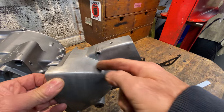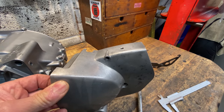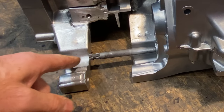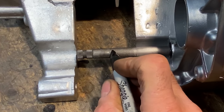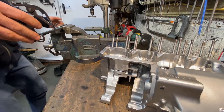To create an original look, the sprocket cover needs to be cut and widened to fit the wider engine. Starting with the gear chain shaft, I insert it into the engine. I need to extend it by 48mm, but first I'm going to cut off a bit at the spline, so I mark a position in the centre with the marker pen, remove the gear chain shaft and put it in the vise for hacksawing.